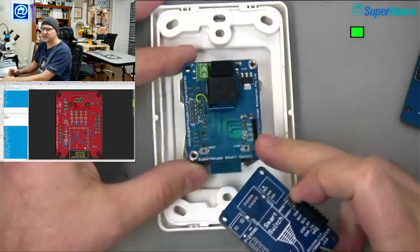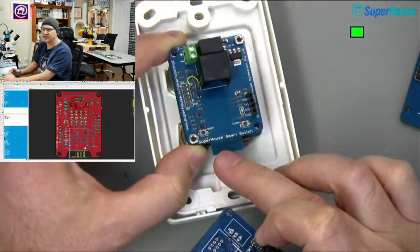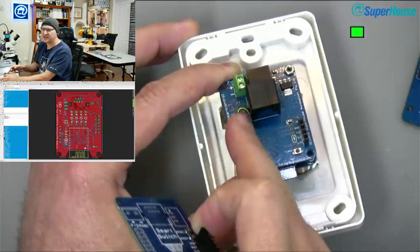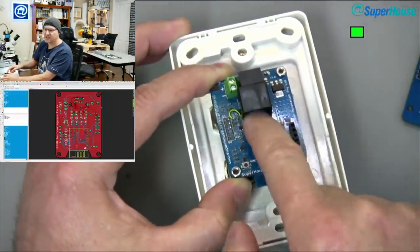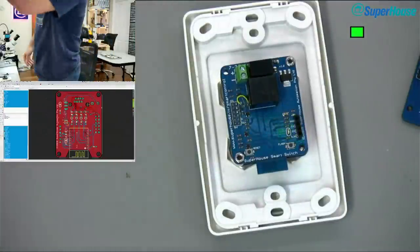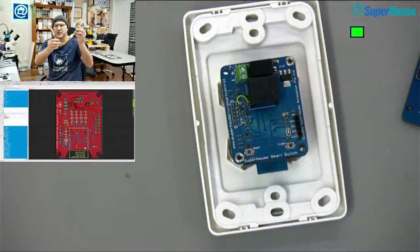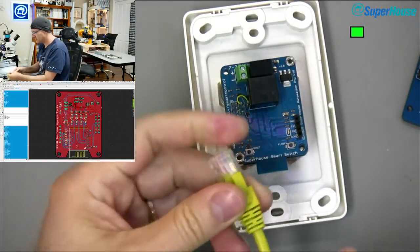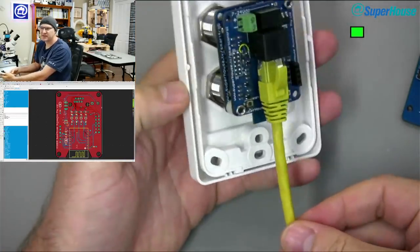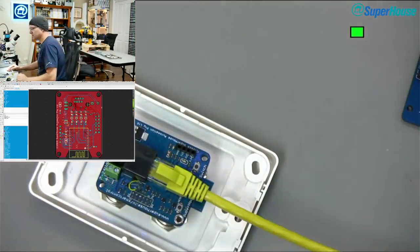This is the previous version. I've got the ESP12 module under the PCB on this one, connector on this side, and I located the parts down the sides of the PCB to keep the center area clear so that if I plugged in a cable it wouldn't obstruct anything. I'll grab a little patch lead — what I have here is a little RJ45 patch lead with a PoE injector attached to it. The idea is that this plugs in like this, inside the wall providing the connection back to the light switch controller and providing power.